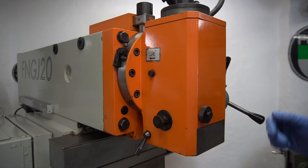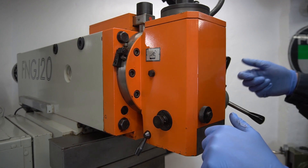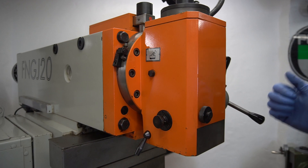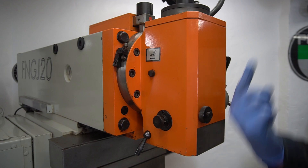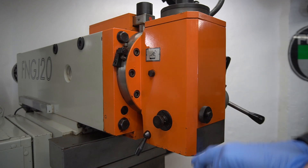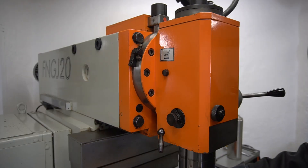And that means if you loosen it and turn the handle, you can either loosen or make the spring tighter. You can adjust the tension of the spring, depending on what tool you are using. If you're using a large facing or boring head and using the quill, it can be a solution to help the quill move up. If it's too loose, it will pull the quill downwards. It's personal preference and depending on what type of job you are doing.